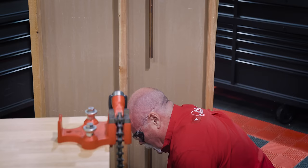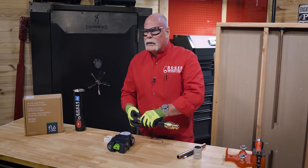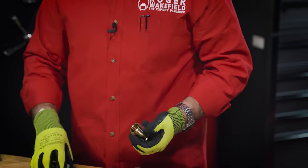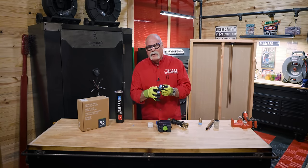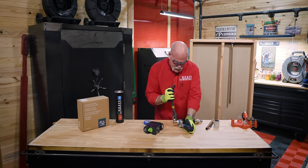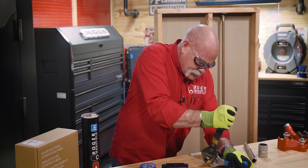We cut out our piece 10 inches long. I'm going to go ahead and get both ends ready. Now our adapters — I'm going to go ahead and prep them. That way, once we cut this in, we just install the valve and we're ready to go. If you're a plumber, do you understand how important this would be for your customers? If you do leak detection, slab leaks, anything like we do, imagine going out to a house that has already had issues and being able to say, 'Not only can we find this problem and fix it, but we can help you make sure this never happens again.' Don't over-tighten things — let the tape do its job. Get it good and tight but don't over-tighten. You want it tight enough that it's not going to leak. This is ready to go in.